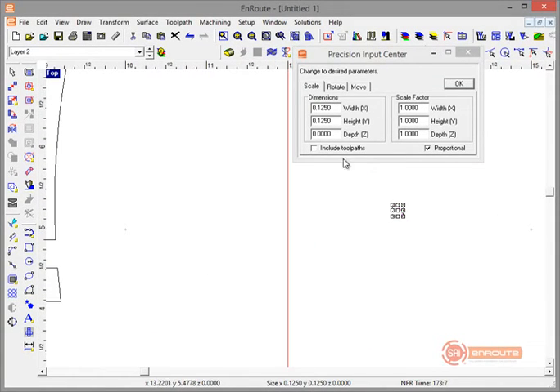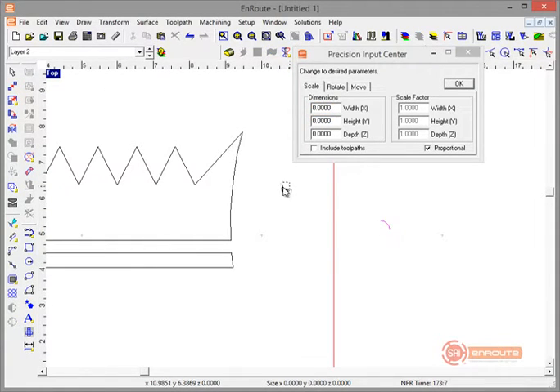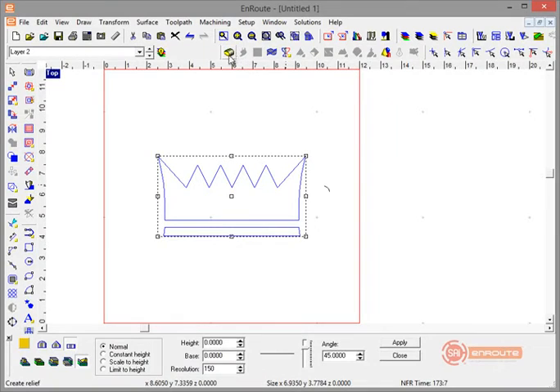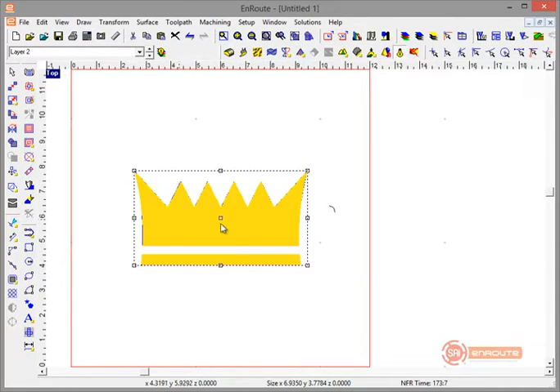Actually let's make it a little bigger — 0.25 — to create a slightly larger shape. Now I'll select my crown contour and use it to make a 3D surface inside these contours. We'll choose a flat profile, add to the relief at 150 DPI, and hit Apply. We've now created a 3D surface just inside the area where we need it.